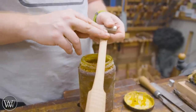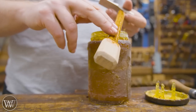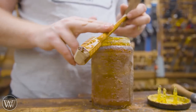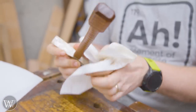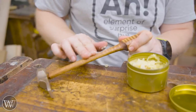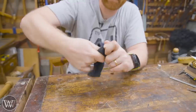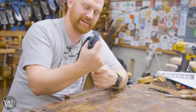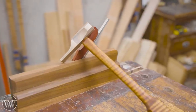Now for the boiled linseed oil — and this torrified curly maple is just gorgeous. The chatoyancy on this is happiness. I really love this torrified curly maple; it just pops with the oil. With the boiled linseed oil, you want to let it soak up as much as it can. I put on several coats, just one after another, over the course of 15 to 20 minutes until it stops soaking it up. Then we come in and wipe off the excess with a rag. Then I'm going to put on some paste wax — this is a soft wax that I sell — and work it into the surface. I'm going to let that sit for 30 minutes or so, then come back with a rag or an old sock and polish it. The feel you get after that with the wax on it is absolutely beautiful.